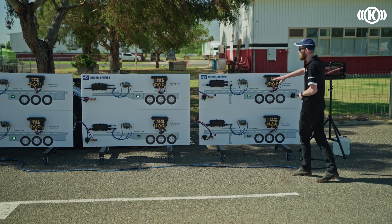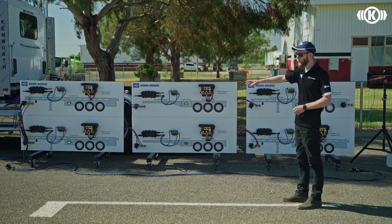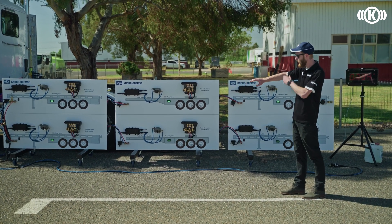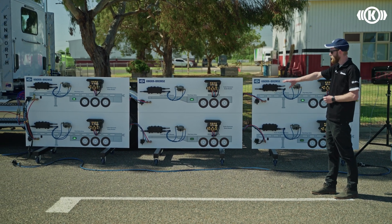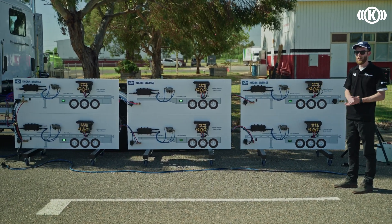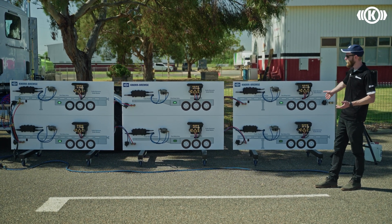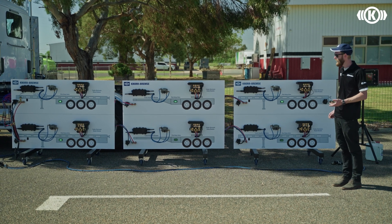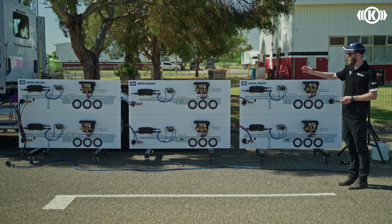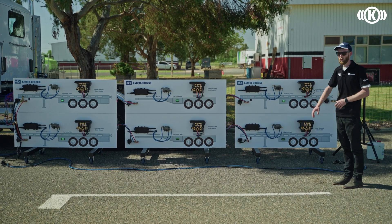The top combination has applied the brakes at the same time with output forces to each one. On the bottom combination, we've only managed to apply the brakes on the first trailer because of the buildup of crack pressures — there's enough control line signal to overcome the crack pressure in the first relay valve and apply the brakes on the TEBS module, but not enough pressure to overcome the second one and apply brakes on the second trailer. So as the driver goes down a slight descent to wipe a couple of kilometres off, he lightly applies the brakes expecting the combination to brake together, but he'll get the rear two trailers pushing the combination down the hill slightly, creating compounding heat in the first trailer and the steer axles. But with an electronic control signal, that light brake application is sent direct to each module with the same demand — no delay and no pressure loss in the signal.